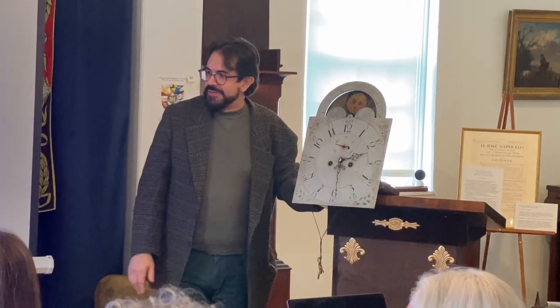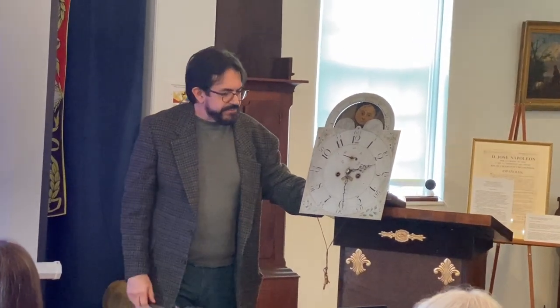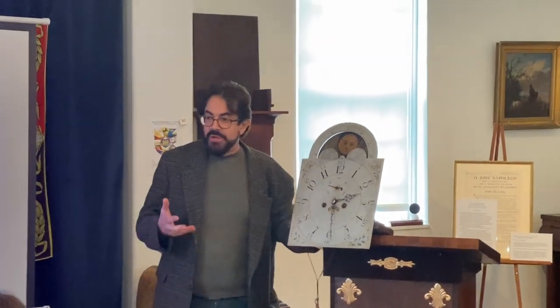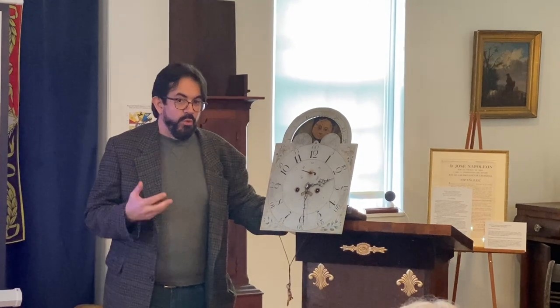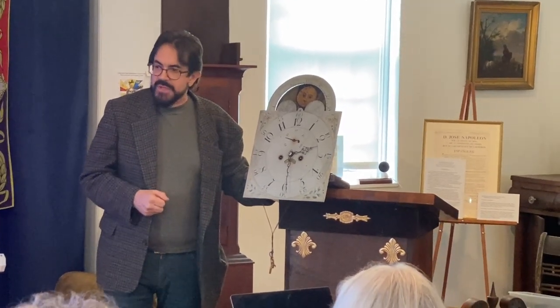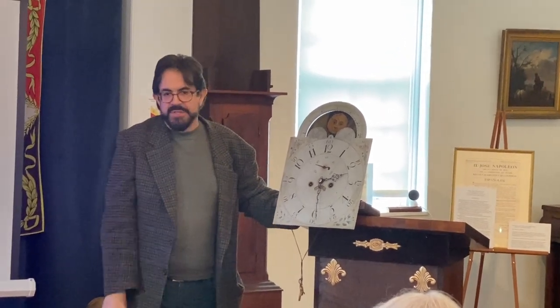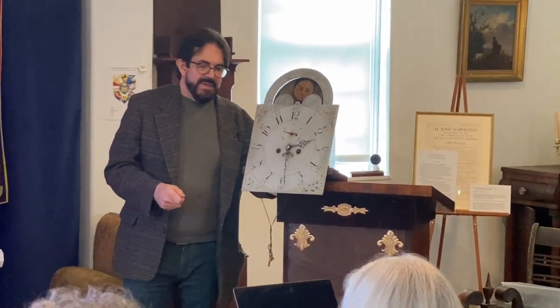So anyway, that's how you know by the color of the brass, I know it was not properly cleaned. The Howard Millers of the world, those kinds of movements, the Hermle movements, they can go in an ammoniated solution. Those components of those clocks are rolled brass. They're work-hardened brass, whereas this is cast, the plates and the gears are. So this is four times softer than those new mechanisms that are out there. Anybody else have any questions on that?